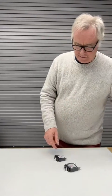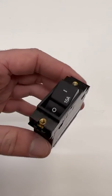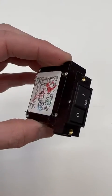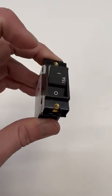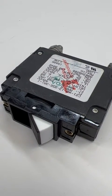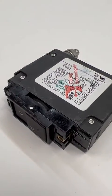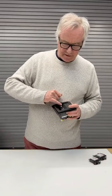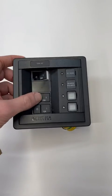Using the 360 panels we also have rocker breakers. These ones are known as flat rocker. When they're on, the rocker is flush, and when they're off it sticks up with a white exposed edge. Again, the A-frame comes in sizes up to 50 amps and the C-frame comes in sizes up to 100 amps. The interesting thing about these is they'll fit in the same cutout even across the different sizes of breakers. Here's an example of them loaded in a panel — the top one has just a single actuator but it's a double pole breaker, and then we have two single pole breakers.